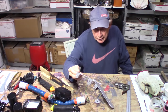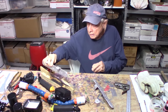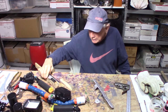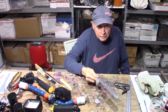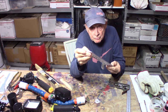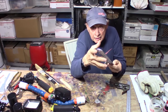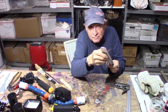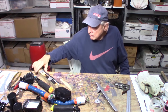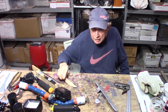I went ahead and put the time in and put together a whole new project. I put it between two pieces of lumber like this to insulate it in the vise. If you take this piece of metal and you heat it, the heat will go through it very, very fast. And if you have it clamped in a vise, that heat will transfer into the vise and you'll lose some of your temperature. By having it insulated, I'll have a little bit longer time to retain that heat and make my bend.